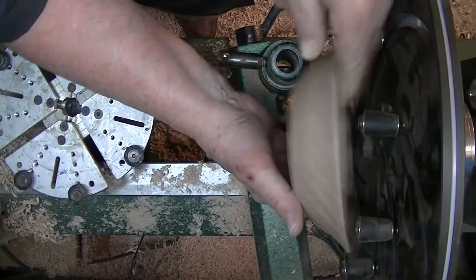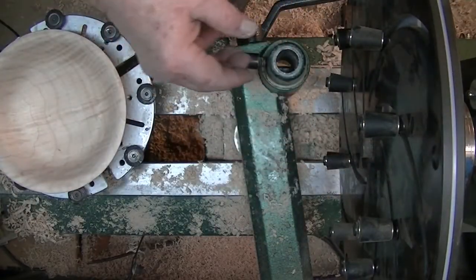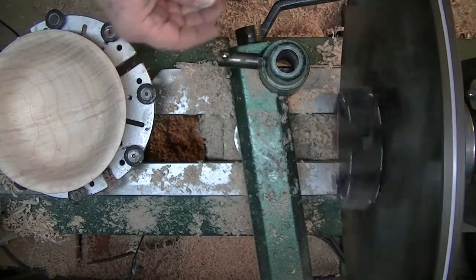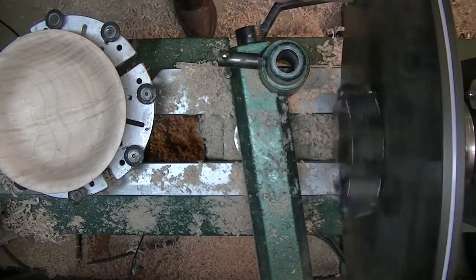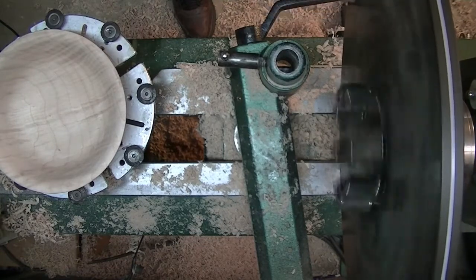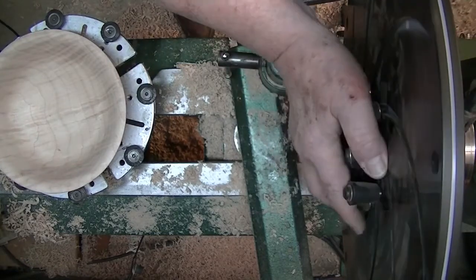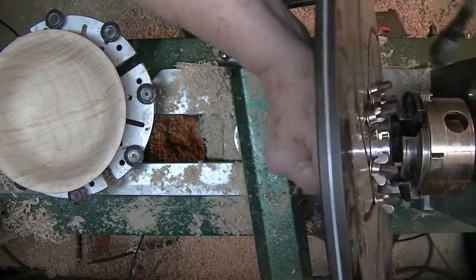The problem is that with big jaws like this, you must run at a fairly low speed. That's a pretty big piece of material to be flying around. So keep your speed low. Now there's another thing, that's just another set of jaws. Let's take this out and set it aside.